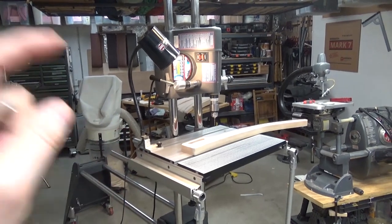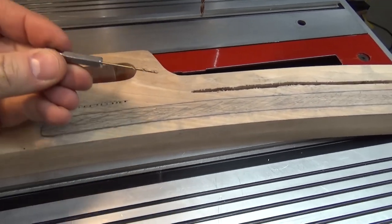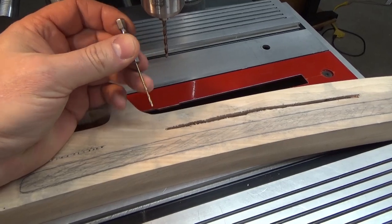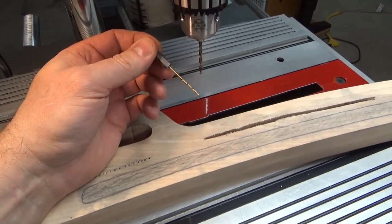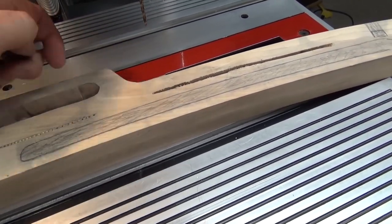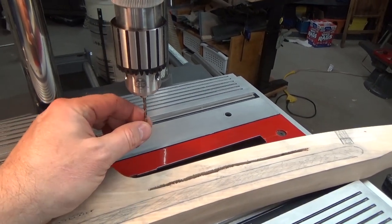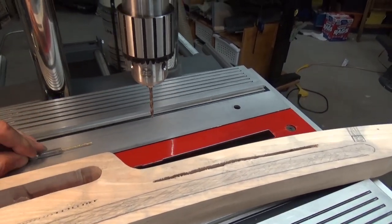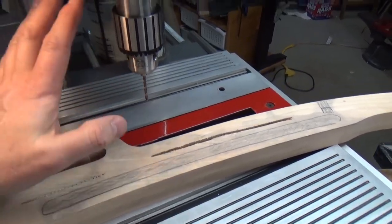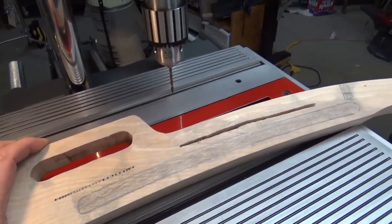Another blessing is I have access to an excellent drill press. I think I might be able to straighten out these holes a little bit, at least from this side. I was using a 1/16th inch drill bit and was hesitant to use it in the drill press because it's so thin — the power of a drill press is just too much for a thin bit like that. But I've accepted that these slots are going to be a little wider than design. I've put in a 1/8 inch drill bit, which will still flex but not as much, and it should be okay in the drill press. For the rest of the parts, I can drill out most of the waste with the drill press, make sure everything's square, and then it's just cleaning up — a process that should make this look a lot better.